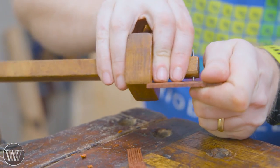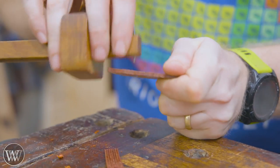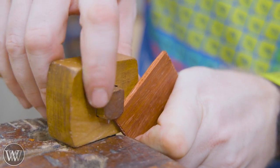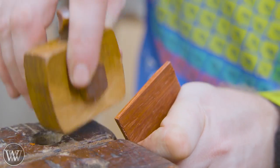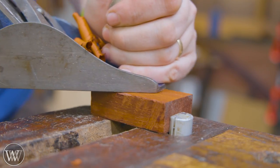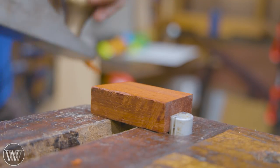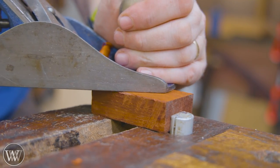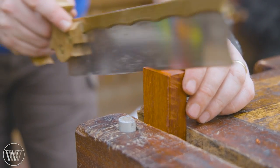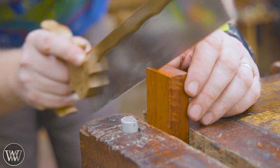I've made a couple of these in the past. I've done one out of a solid piece and those don't last quite as well — it's usually best if you laminate them. All of these pieces have been stabilized, so they are fully filled with polymer and will not move quite as much, but they also make it a little bit stronger so they hold together better. These need to be very, very thin pieces — we're basically making thick veneer.